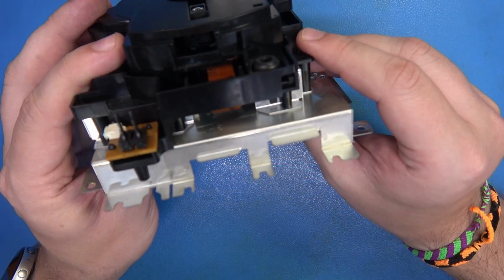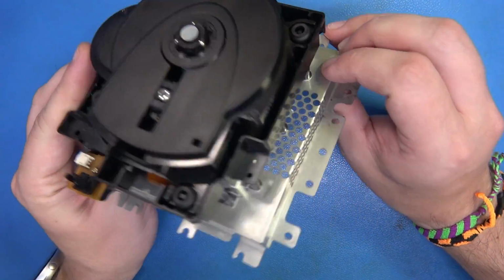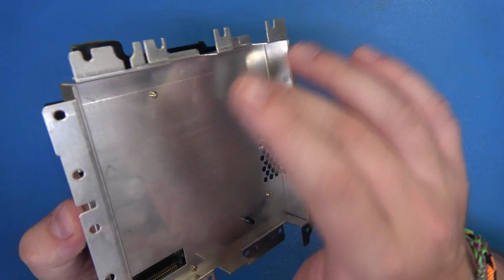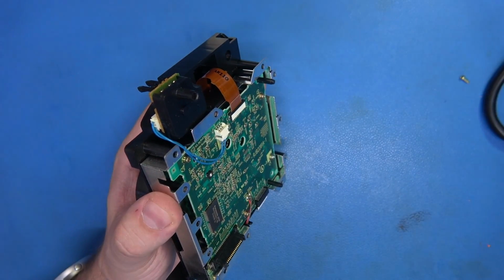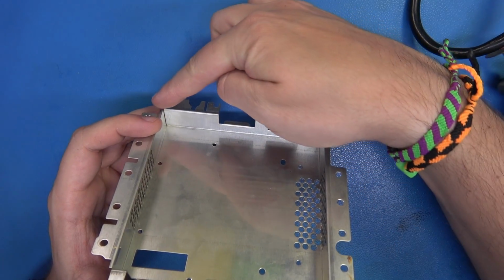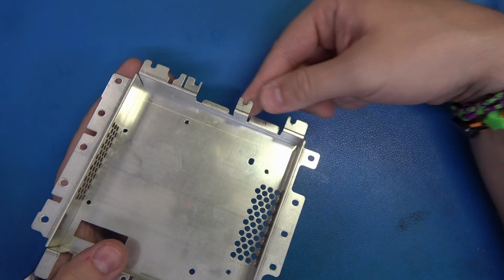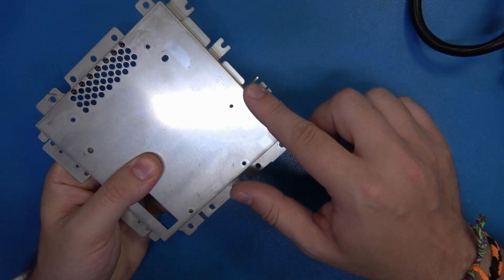Cutter flush. Now, in order to accommodate the Pluto board, we're going to need to remove this back section from our optical drive's housing. So these small Phillips screws will decouple this metal shield. Let's take this off so we can more cleanly work with it. Now our RF plating is off here. What we need to do is remove all of this material from the back side, and we need to stop right here at this flap. So effectively, this little standoff right here, all the way forward, we need to cut this out so that our Pluto board can live in here nicely.